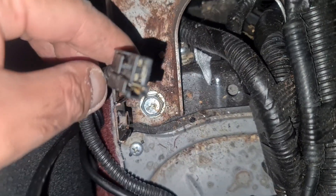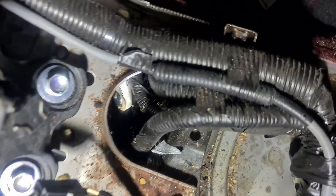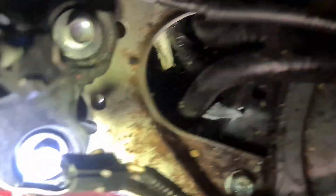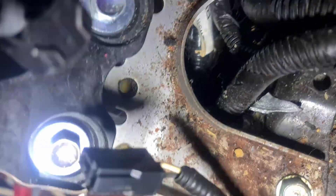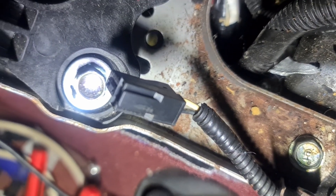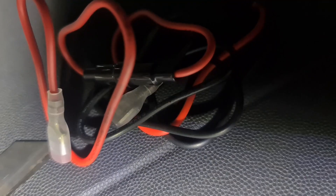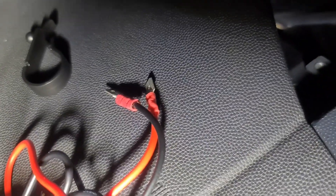I will test them and I'll tell you in a minute. As I suspected, the creamy white wire is the live and the black is the earth — sorry about the light, trying to hold three things with one hand. I have already terminated these wires with those spades on the end. So red will go to white, black will go to black, and then those two ends will go to the other end and I'll insulate those.